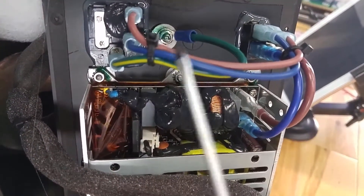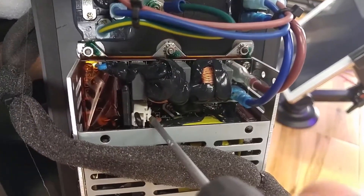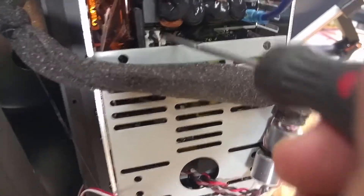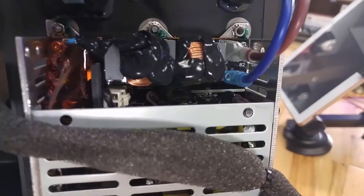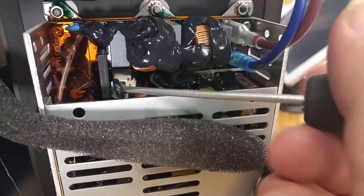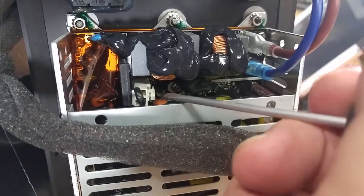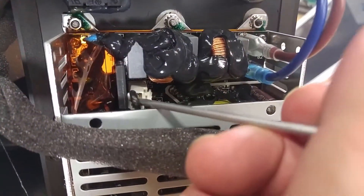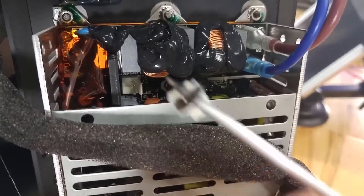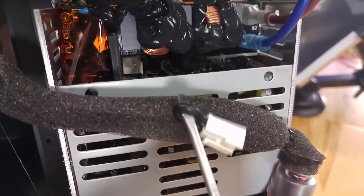Again, the amplifier is now upside down, so this is the top, which is relative to the bottom. We want to take this little plug off. You can't read it in the drawings, but it actually says in there what it's for. Once you get that, you'll pull this out — make sure to release the little mechanism on the side. You've got to push that in when you pull this out. Once you do that, it will come out, just like that, and you'll be left with just the actual connectors. With the jumper removed, this speaker is now 220.